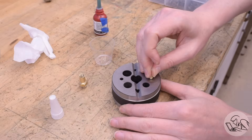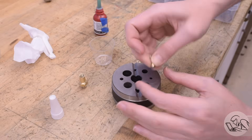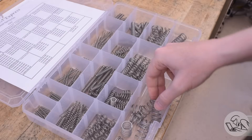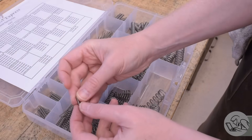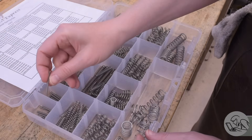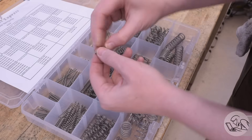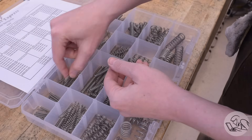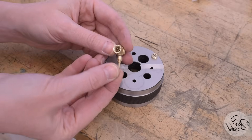I can do some assembly now. The ball bearing is a press fit in the pocket, but just for good measure I threw a little Loctite in there as well. Now we need that all-important spring, and of course it has to be stainless steel because this is a steam environment. I bought this set of stainless steel springs rather than making my own. Fun fact: if you go buy any of the many cheap stainless steel spring sets on Amazon at one-tenth the price, you'll find that none of them are actually stainless — they're galvanized and will rust within minutes of contact with live steam. Buy from a reputable supplier if you need your stainless steel springs to actually be stainless and not just shiny.